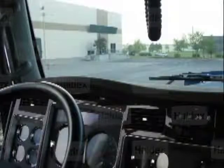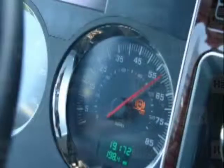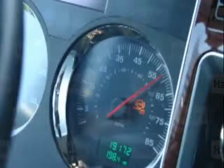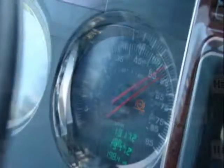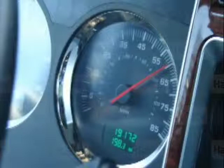What do you do if the in-cab trailer lamp starts flashing while driving down the road? If the in-cab trailer lamp is flashing while driving, constant service brake air may be the cause. It is extremely important to pull off the road as soon as possible at the safest location near you to identify the problem. The in-cab trailer lamp will stop flashing when the vehicle stops moving. Pull the yellow dash valve to park the tractor. The brake monitor alarm will turn off when the vehicle is parked.